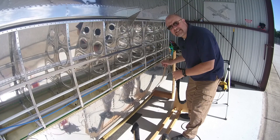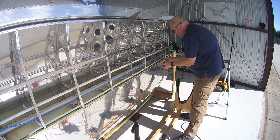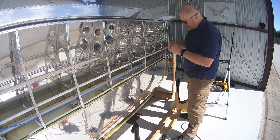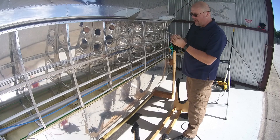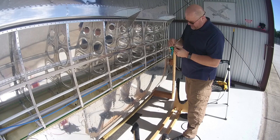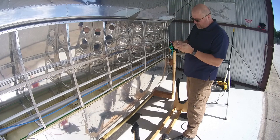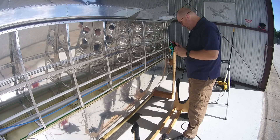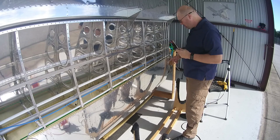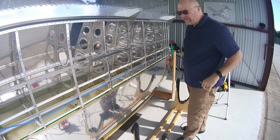Holy shit, it works — success! This system works out really well and this screw is coming straight out. I drilled down just a little bit, really just enough to get purchase for this backwards-threaded extractor bit. It looks like I didn't drill through the material at all, so that should be fine. I did go to a handheld as opposed to a drill — I figured doing it by hand would be better. I did have to get the bigger, beefier drill to drill into the screws since my little cordless drill just didn't have the oomph. Now I just got to do a couple more.